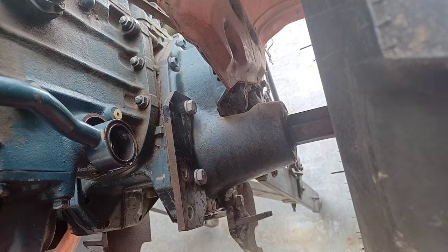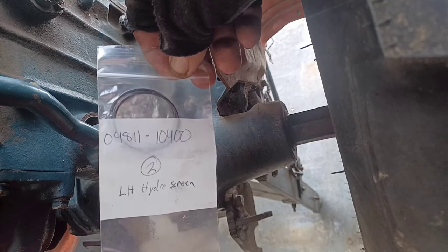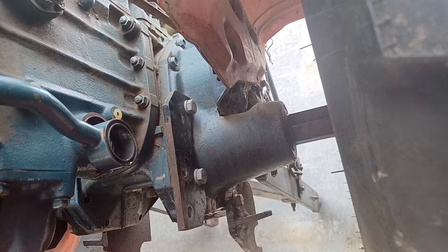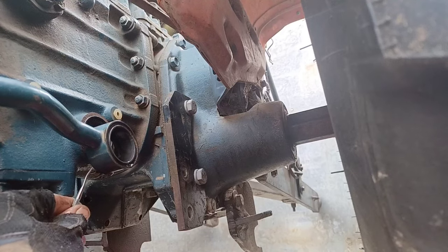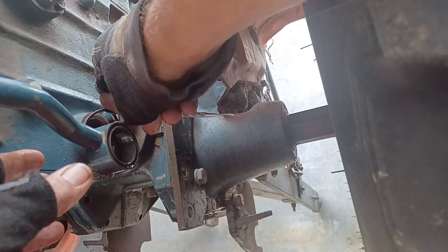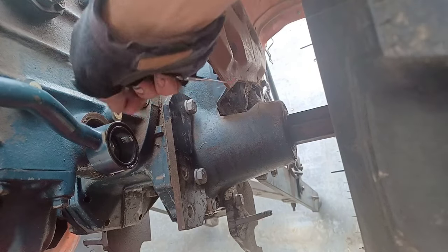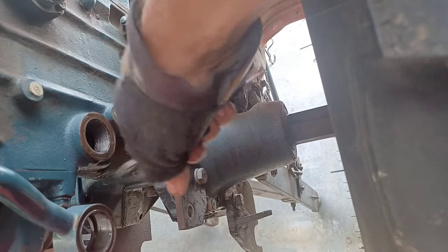Okay, same thing on the left hand side of the engine, except we've got the O-ring 04811-10400. The outside O-ring already came out with the strainer. Looks like the inside O-ring is actually stuck in the hole and not in the pickup tube. Yep. Alright. Now that actually doesn't look incredibly healthy. We're going to clean that up a little bit before we...